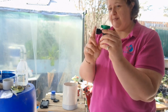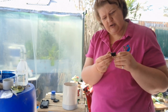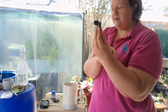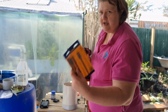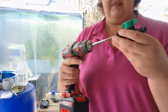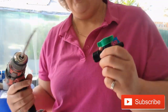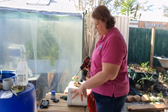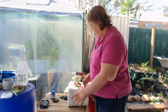I'll be screwing this into the PVC pipe — it's 20mm going in, stepping down to 13mm, which is the aquarium hose coming up into it, and 15mm going into the actual pipe. Using hole saws, I've worked out that 25mm will give a nice hole for the valve fittings. I've tested the holes first to make sure they are the right size. There is a cap on the bottom of this pipe to hold everything where it needs to be.